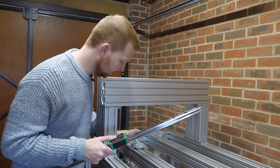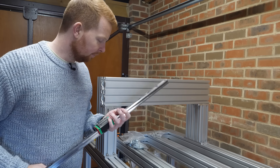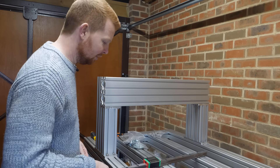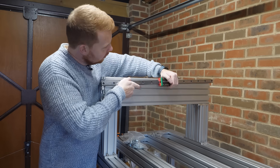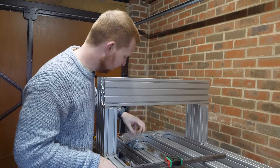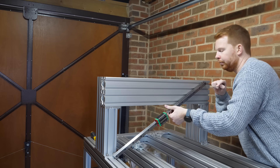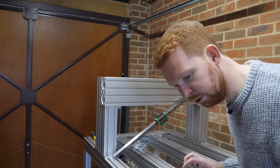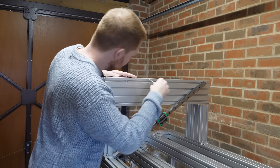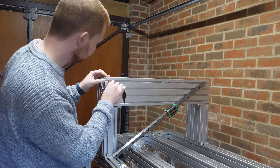For the axes of the CNC I've gone with these huge linear rails. They're probably a bit overkill for what I need, but when I ordered them online they didn't look as big as they turned out to be. Regardless, we need this thing to be strong. I'm going to attach this to the gantry using quite a few bolts — luckily I have a whole bag of them. I may need to order some more nuts though, as there are a lot more nuts per rail than I expected.